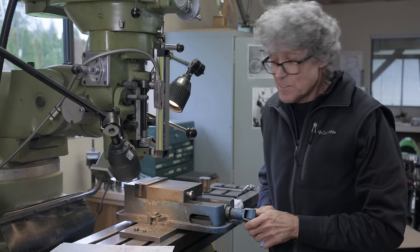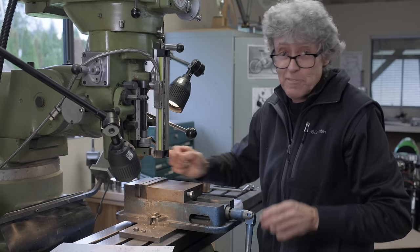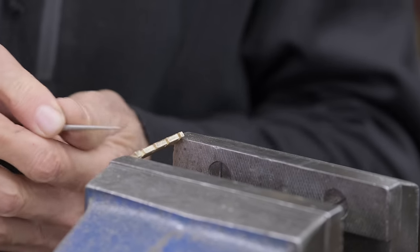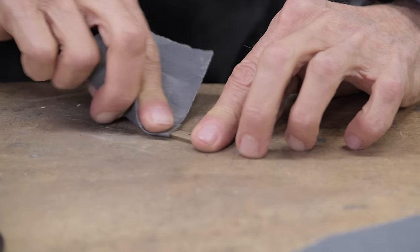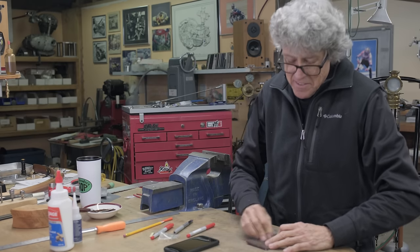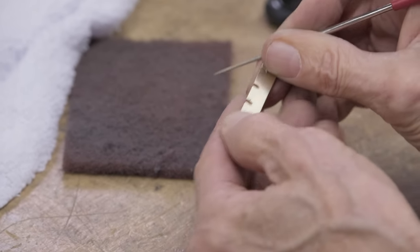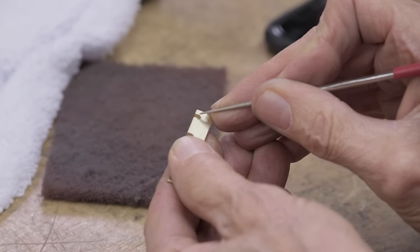We're gonna do a little bit of filing now, see if we can salvage this so that you can look at something anyway. Not exactly happy with this, but my first nut. I can show you all my mistakes here. I'm just counting them. I came up with 4 things for such a little piece. That's where the center drill hit down and it was off center. Then after that, I put the slotting saw in the wrong position and it was off by 23 thou.